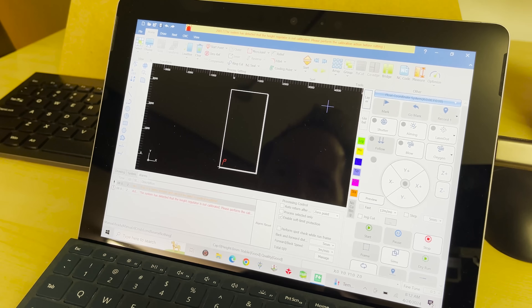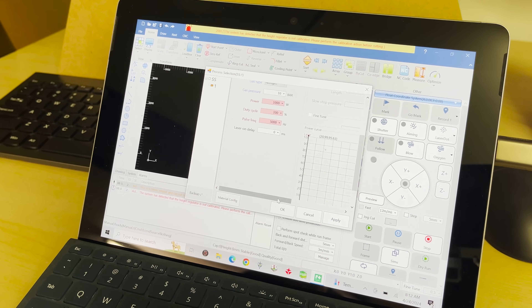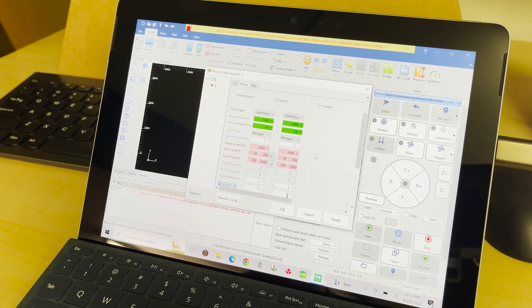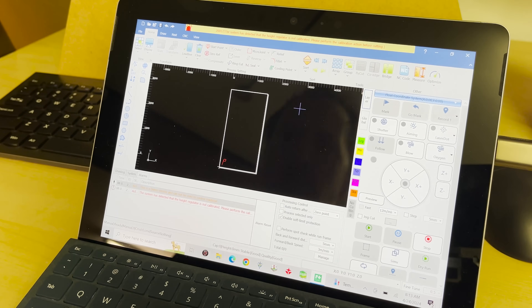The second hurdle is going to be software. These fiber laser specific controllers come paired with software designed specifically for fiber laser cutting. Many will include features for multi-stage piercing, laser head focus control, gas pressure control, corner compensation, part nesting, etc. From what I've seen, other laser cutting software such as LightBurn just isn't going to have all these features. Maybe you could write a custom post processor for Fusion 360 or SheetCam to generate the proper G-code — but let me know in the comments if you have any good recommendations for this.